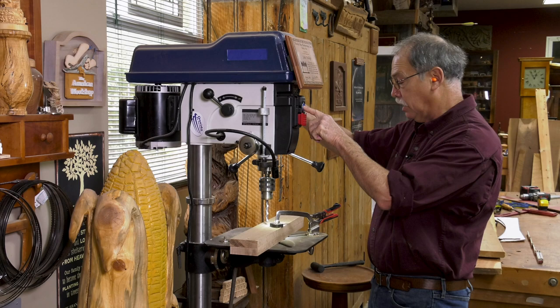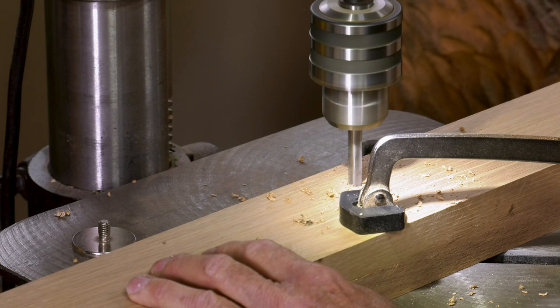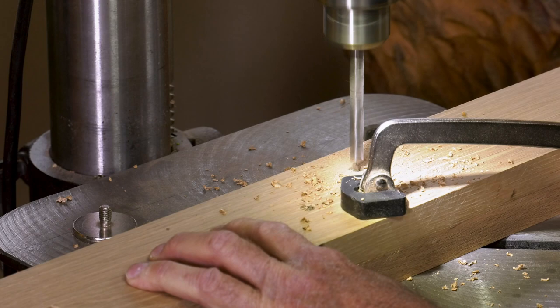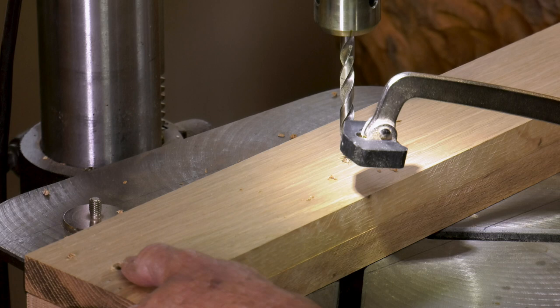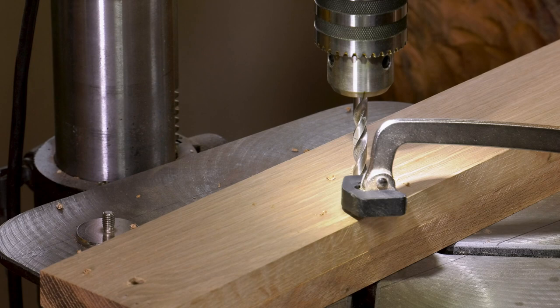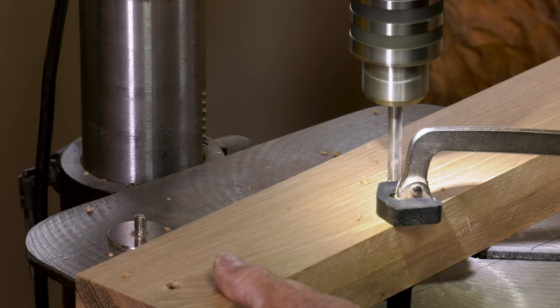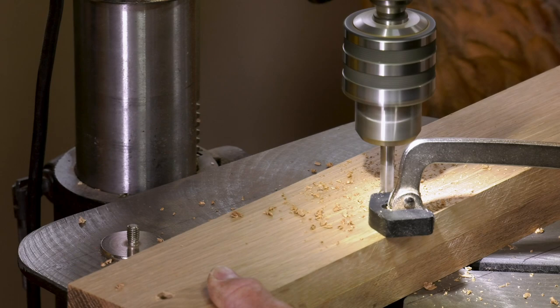My two leg work pieces are stacked on top of each other — just shy of an inch thick white oak, clamped in place, three and a half inches wide and 21 and three quarters long. These will be for the two front legs. I'm using a Brad Point Forstner bit, and I'm not trying to force my way through the wood, just cutting my way through. It always pays to use good sharp bits. I wouldn't dream of drilling a work piece on the drill press without clamping it securely to the table.